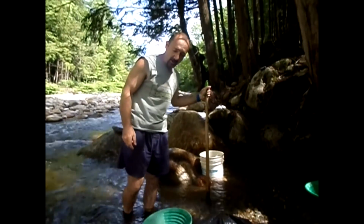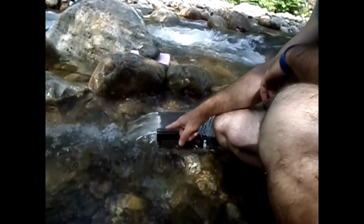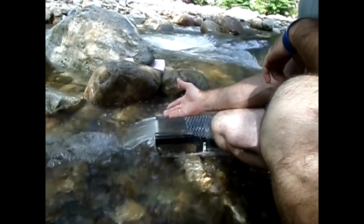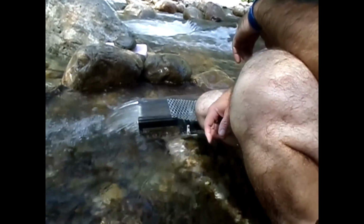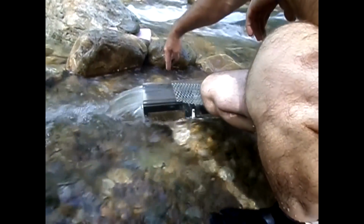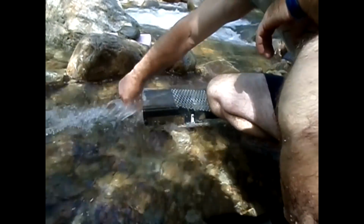See what's going on inside the trap. Right down here, we see that at that front wall where the tubes terminate, that everything's working good. We've got good action inside the trap, so we know that the scoop is charged up well. So that's what I'm looking for, making sure that it's not blowing out in the center, and I want to see that everything's fluidized and working properly inside the trap. So we're good to go.